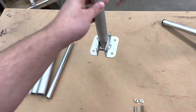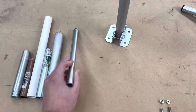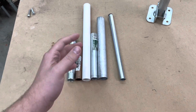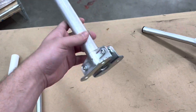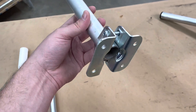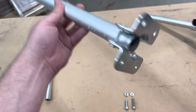That's really cool, and it got us thinking — what about other pipes? It turns out you can use the flange with half-inch EMT conduit using the normal hardware. Really, any pipe up to one inch in outer diameter works with the included hardware. Anything over one inch in outer diameter — like this one-inch EMT conduit, which has an outer diameter of around 1.126 inches — will require the longer hardware. I wouldn't go too much bigger than the one-inch EMT, but it does work well.